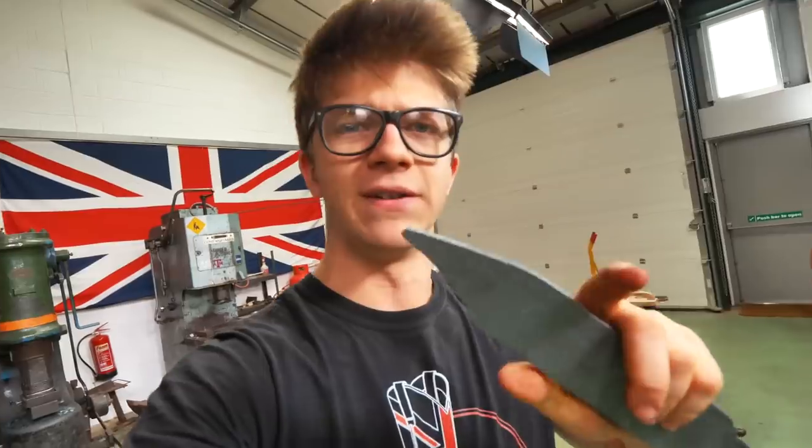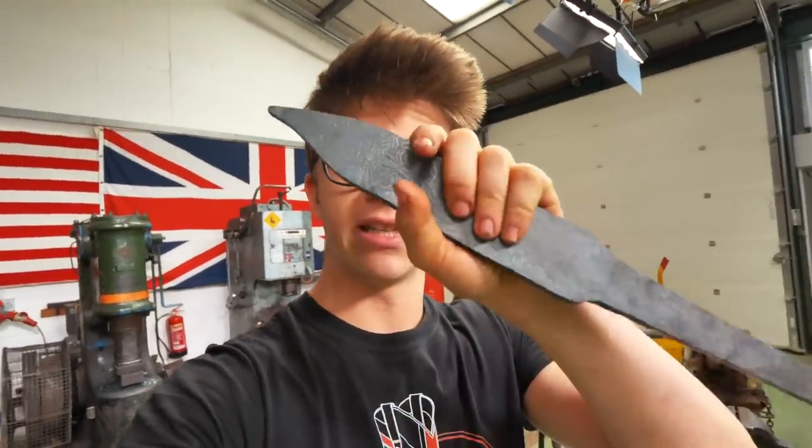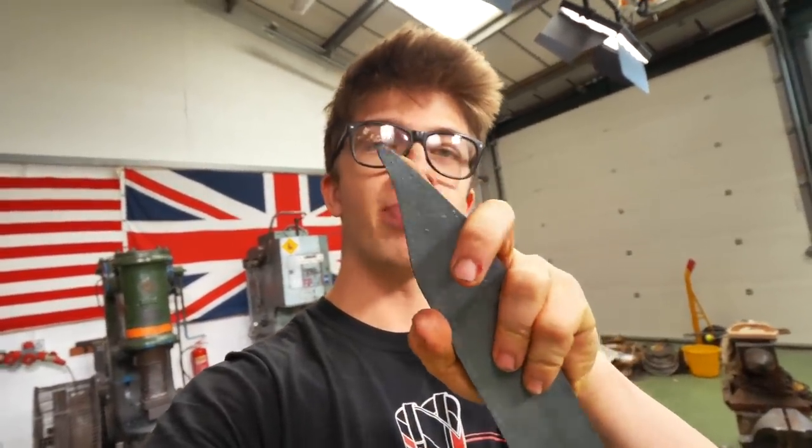This time it's on something that, if it breaks free, could spin around and hit me. Maybe I shouldn't be doing this — but in true style of what we do here, when we don't know how to do it we just get cracking and give it a go. First thing on the agenda, I'm going to get a rough profile in here so I have something to work off when I do the other bits of machining. I'm going to leave it proud at the tip and proud at the tang so that once I weld in those areas I can grind it out without destroying the profile.